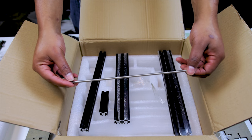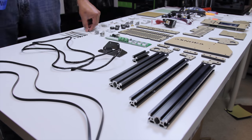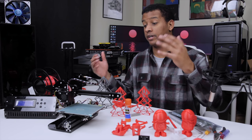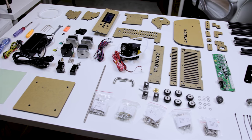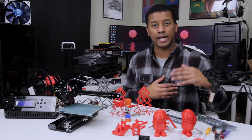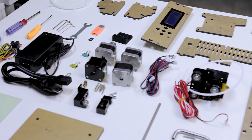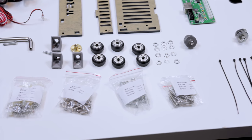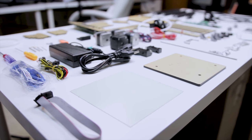Finally, we had the lead screw — a fairly small M6 lead screw. After getting everything unboxed, I laid everything out and knolled it on the table — I find it kind of therapeutic, and it helps me match everything up to the nice parts guide. I actually was missing two screws, so luckily I had a set of metric screws on hand. I'd encourage you, if you're doing kits like this, to buy some hex head and Phillips head metric screws — they've got sets for like $20 and can be lifesavers.